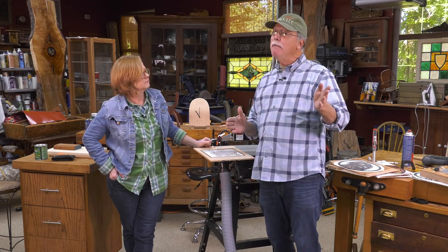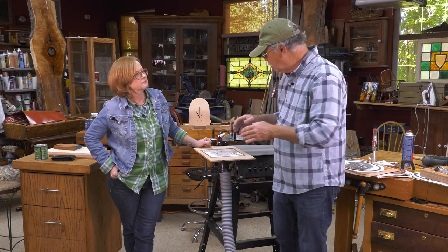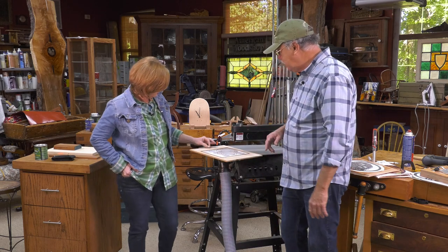Then you have the back of the blade — when you put pressure on it, that's how you pivot the blade 90 degrees or 180 degrees, completely flipping it around without the side of the teeth or the front of the teeth stopping you. That's how you make swing cuts.